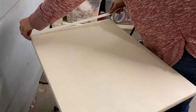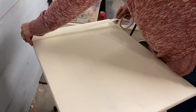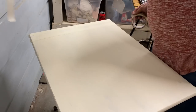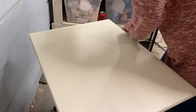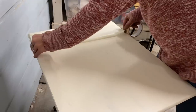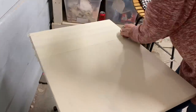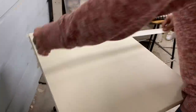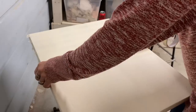Once I got two coats on this and let it dry well, I didn't want the same mishap to happen with the tape like happened with my tray. I know that was because of the white wax, but I still took extra precautions and sprayed a clear finish on this before I started doing my taping off. I'm not doing my grain sack striping on here — I'm actually going to do just stripes all the way across the top of the table. To do that, I'm just going to tape one piece of tape after another beside each other and then remove every other one, and that's how I'm going to do my striping. I'll just go across the whole top taping, and when I'm finished, I'll go through and remove every other piece of tape, and that will leave me a stencil to stripe the whole top.